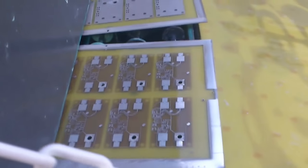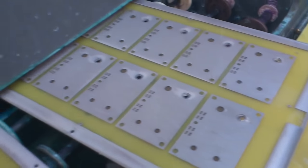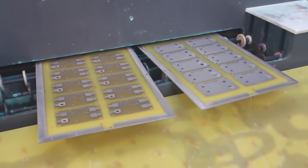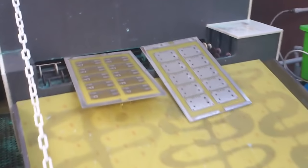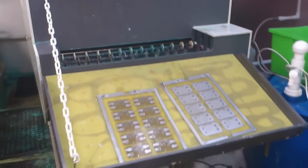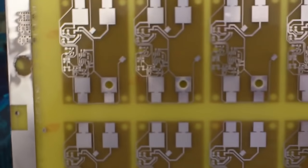Next it goes into the stripper solution, which strips off all of the photoresist so we're just left with our tin plate and copper. Then we put it into the etching — you can see it's just blue everywhere; that's ammonia solution, likely ammonium persulfate, coating everything. Manufacturing processes are messy. And here we have it: our beautifully fully etched PCB with just the tin plate left. Older processes might have used a positive photoresist and etched away the copper, then done a roll tin plating process over it — but roll tin plate is pretty poor quality. There are our completed boards with our plated through hole.